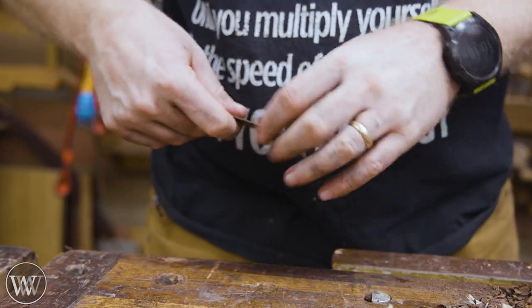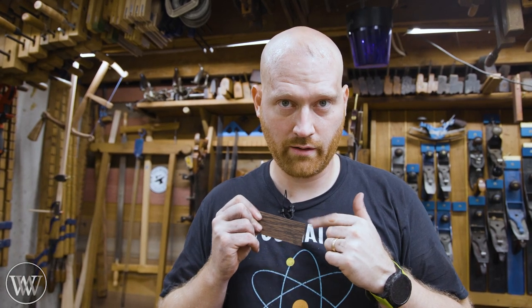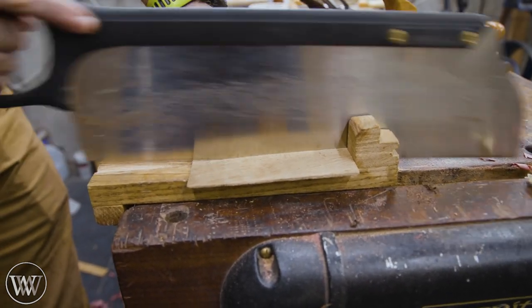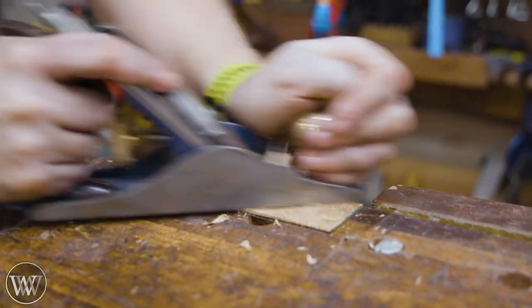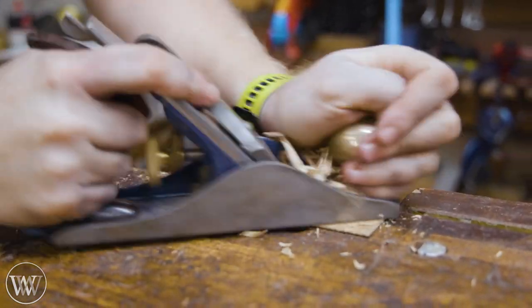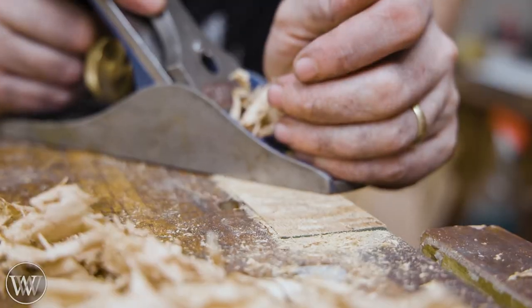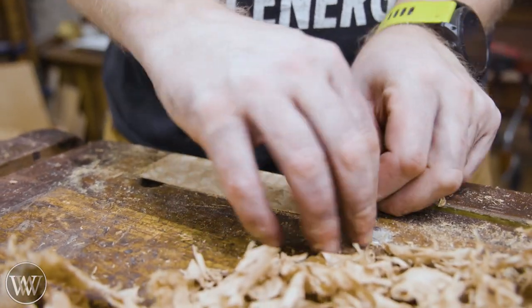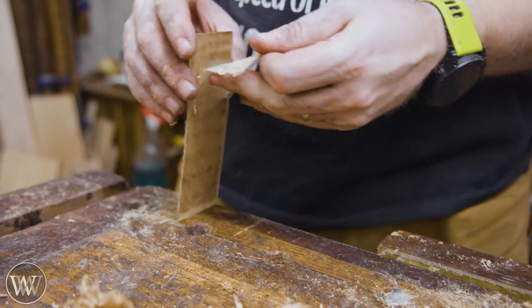For the last one, I decided to really make it difficult on me — I went with curly white oak. And if you've ever planed curly white oak, it is an absolute pain. The grain goes every different direction, so you have to take your time and do it with a good, well-set-up smoothing plane. I've got this piece I cut off a project probably five or six years ago that's been in my scrap pile. One corner of it is almost the right thickness, and the rest is a good bit too thick. So I'm going to very carefully take off very, very thin shavings. When working with delicate grain, you have to be careful because it's very easy for tear-out to suddenly go all the way through the piece — any amount of tear-out is an absolute pain. I had to be very careful with how I peeled it off, but take your time, let it come off, and it came off actually surprisingly well.